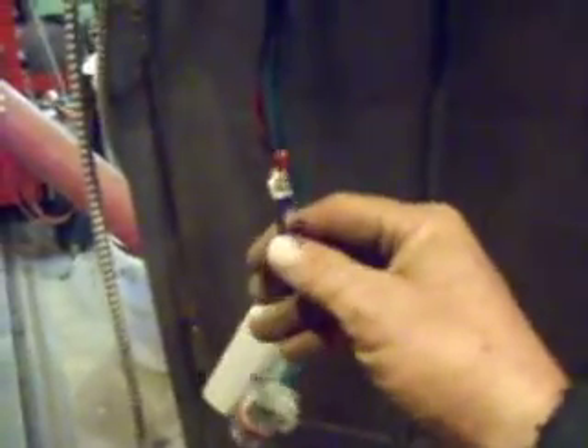This has two different thermostats. One would be taped alongside the hot water pipe going to the house into the heating system, and this one actually sits outside and measures the outdoor temperature — it mounts on the wall. There's a remote trouble indicator that can be mounted in the house, since this whole system sits in another building or even outside. There are switches to mimic the low limit and the high limit, and another switch which is a relay bypass switch. All in all, it's really basic.